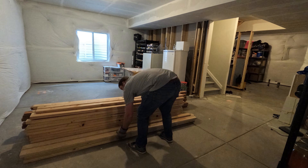Now comes the hard part — we've got to start cutting out the drywall down here, all the way around the edge. The 8-footers will go in this area, and over here where the ceiling's higher, that's where the 104 and 5/8s will go. Alright, that's the wood delivered and all the planning done. In the next video we'll start the framing — that'll probably take a couple of videos.